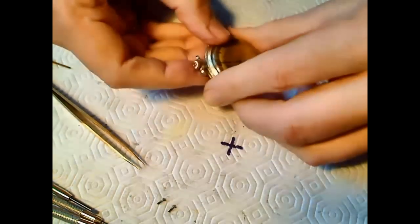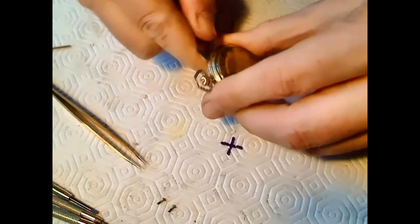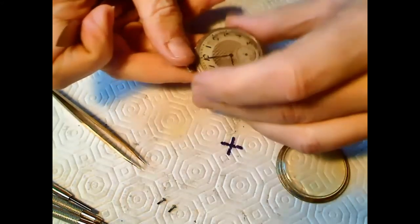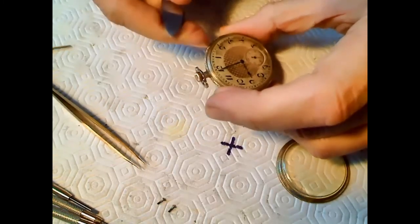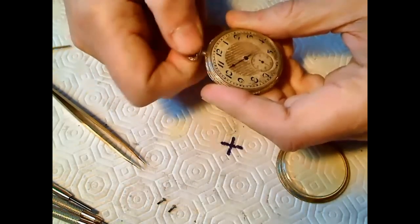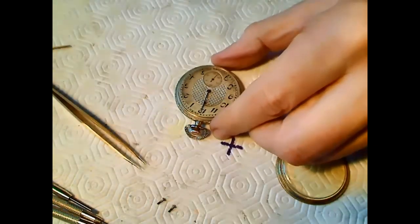I'll close the case and then open it up. Usually you look on the side and there's a little tiny tab hanging out, and then you put your knife where the tab is and work it back and forth. Now it's in and this comes off. I've seen too many people put the knife in and then twist to try to get it off - you're better off putting it in then rolling it back and forth until it finds its way into the crack and pops up. Before I take anything apart, I'm going to pull out the movement and set it to 12 o'clock so when I take the hands off everything is perfectly aligned.